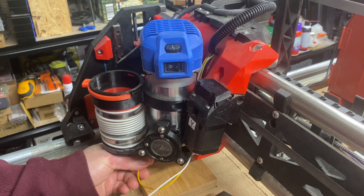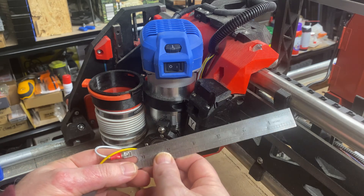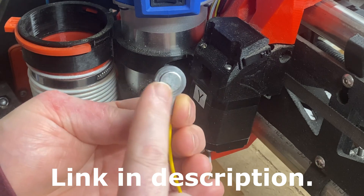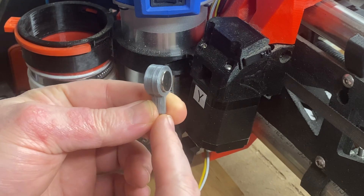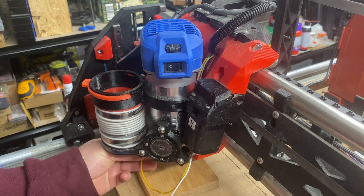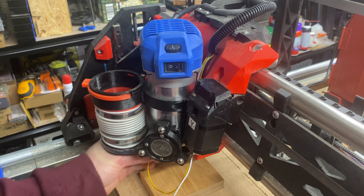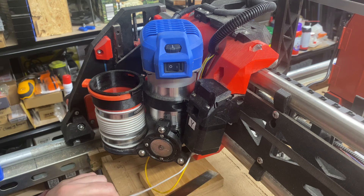I'm using a tiny touch plate. Ryan sells a great tiny touch plate on the V1 Engineering web shop for a very great price. Mine happens to be homemade out of a stainless steel ruler — I do have a Printables listing, I'll put a link in the description. It's a 3D printed plastic two-piece thing that lets me connect the electrode wire to a magnet, so I can magnetically click it onto the collet nut, allowing the electrical signal to pass through the collet nut and down through the bit to make contact with the tiny touch plate.